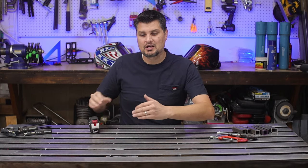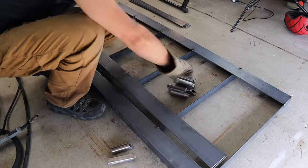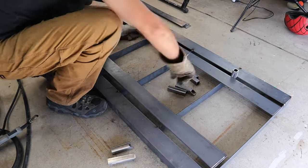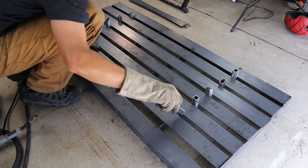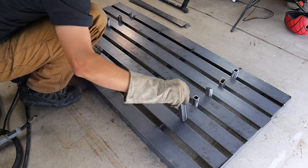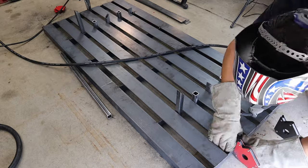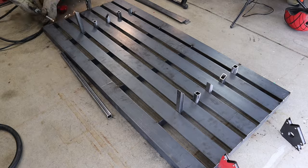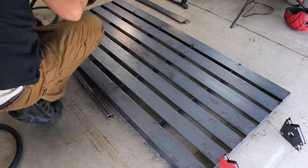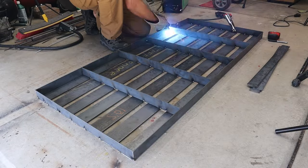My table ended up being 27-and-some-change by 60 inches. The 27 came about because I got seven rows by 3-inch plus one-inch gap spacing, give or take — there is some change in there; I didn't make it exact. I just wanted it longer than 24 inches. The steel lengths come in 20 feet, so I wanted to optimize that and either go with 4 or 5 feet, and ended up going with 5, which I'm glad I did. It just seems like a perfect size table for all my projects.